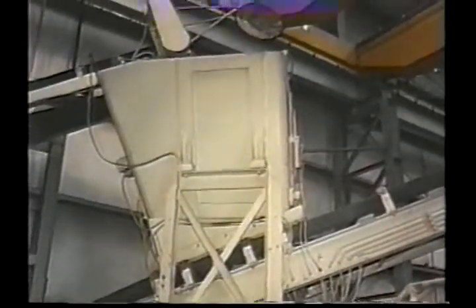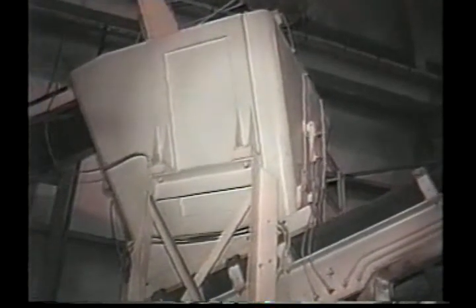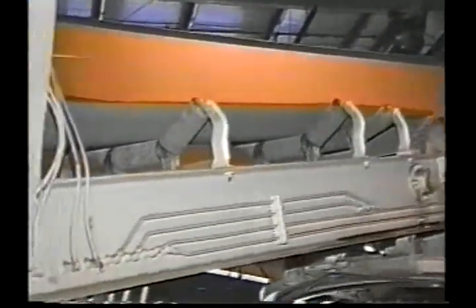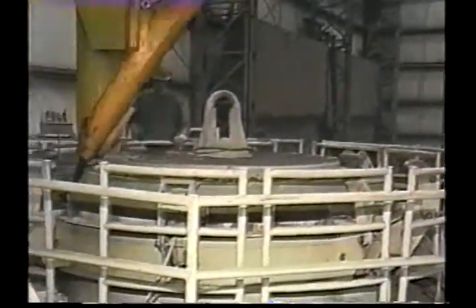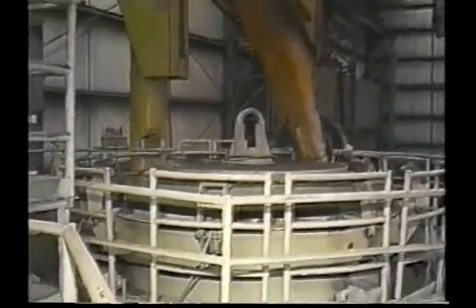Up on the machine itself, additional design features contribute to the machine's capabilities. Material is fed into a holding hopper, fabricated with rounded corners to reduce sticking or bridging of concrete. The hopper is also equipped with an adjustable feed gate on the front and a clean-out gate in the rear. Concrete travels to the distribution head on a contoured troughing belt, designed to transport more material with more efficiency and less loss. The stainless steel distribution chute, which rotates in either direction, ensures a free flow of material directly into the form set, so a pouring hopper on the outer form is not needed.